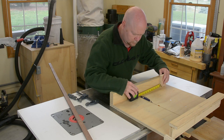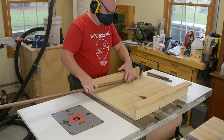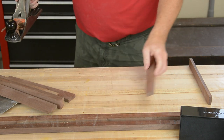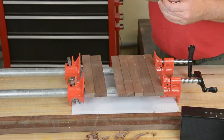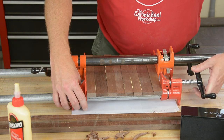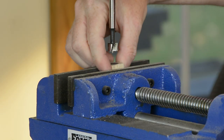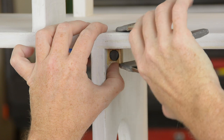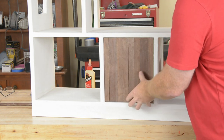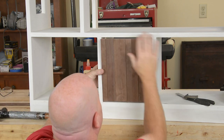While the primer's drying on the case, I went to work on the drawbridge door. I've got a piece of material that hasn't been thickness-planed so it's different thicknesses along its length. I set a stop block for about an eighth of an inch shy of the height of the case opening because the door needs to swing open. The edges have to be nice and clean and straight to glue together well — that's a job for a hand plane. Then glue and clamps — a little odd with pieces being different thicknesses, so you need clamps top and bottom to keep it from twisting. I'm using magnets to hold the door closed, so I need small pillow blocks drilled out with a Forstner bit to epoxy a magnet in. Once the epoxy sets, glue those blocks into the corners of the door opening. There are corresponding magnets in the two upper corners of the door, and then drill pilot holes through the sides and drive pins in to serve as a hinge and hold the bottom in place.